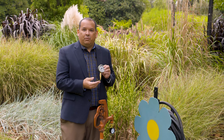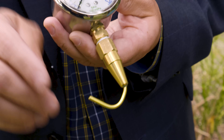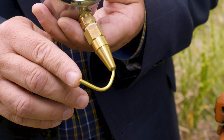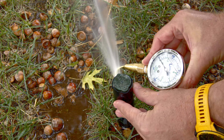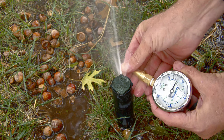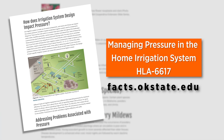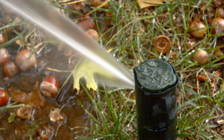If you have a professionally installed in-ground system and you're wondering what the pressure is, there's another tool — the same type of pressure gauge but with a little tube. You kick on the in-ground sprinkler, put the tube in the stream that comes out of the sprinkler head, and you can measure the pressure at the head. For more information, check out the fact sheet on pressure regulation in the home sprinkler system.